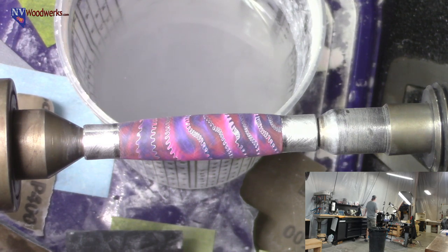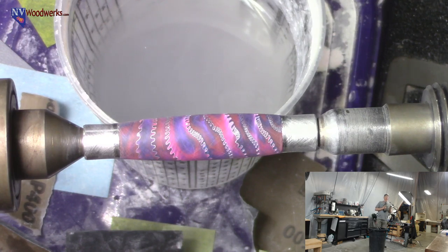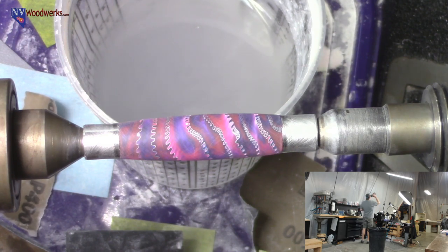Finishing is your favorite? Yeah, I don't know. Do I sharpen my carbide? No, I use the negative rake carbides. Maybe there's a way to sharpen them, but I think the proper way to sharpen carbide is you need a diamond wheel or some other exotic type of material. It's not that hard to sharpen the regular cutters. You can just get a diamond card and rub them on those. But for the negative rake, it'd be so hard to keep it at that angle that it's just not doable, really. Someone might be able to.